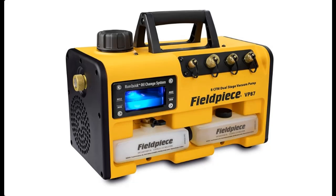Each pump model contains 4 connection ports: 1/4", 3/8", and 1/2". This enables the pump to accommodate multiple hose diameters, providing technicians with more options. Techs are able to use whatever hoses are easy and available for the size of the AC compressor.